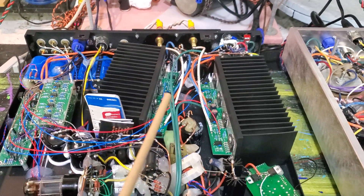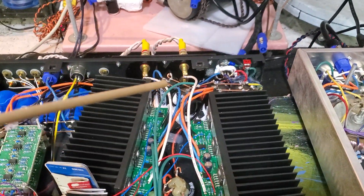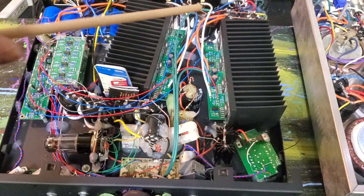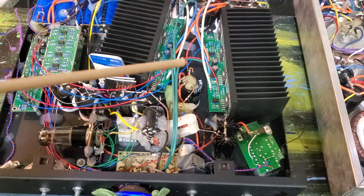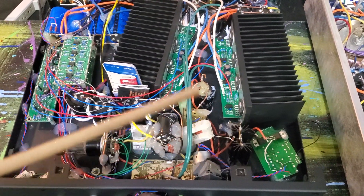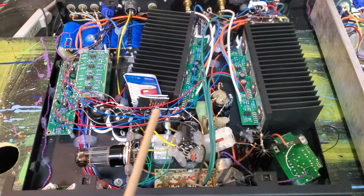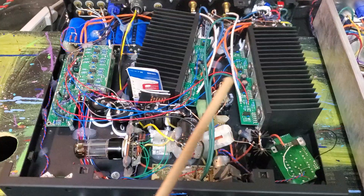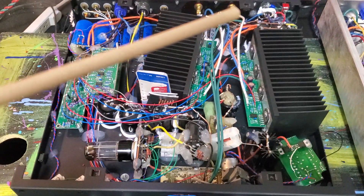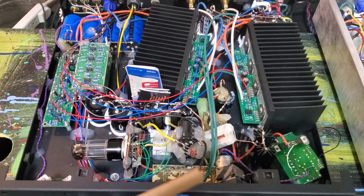The lowest impedance ground path is not always the shortest physical ground wire. Look at this green wire — it is one of the many grounds inside the amp. It runs from the back to the front, and two of them run back to the output stage. Somebody might say, 'why don't you just run one wire from here to here to here — it saves wire and physically it's shorter.' Of course it's shorter, but not electrically lower impedance. I guarantee if you run a wire that way, you will measure almost zero ohms, but you are going to get a ground loop.